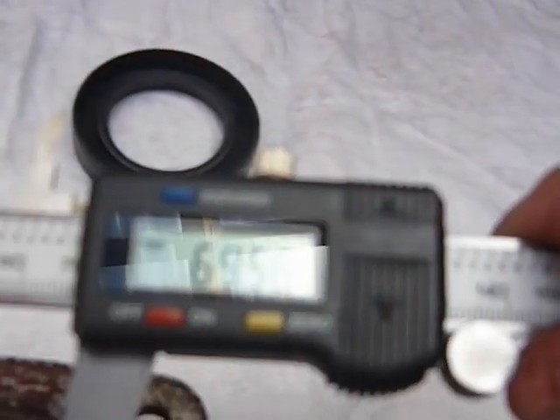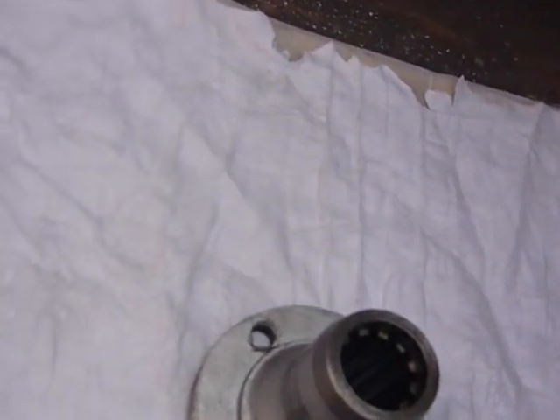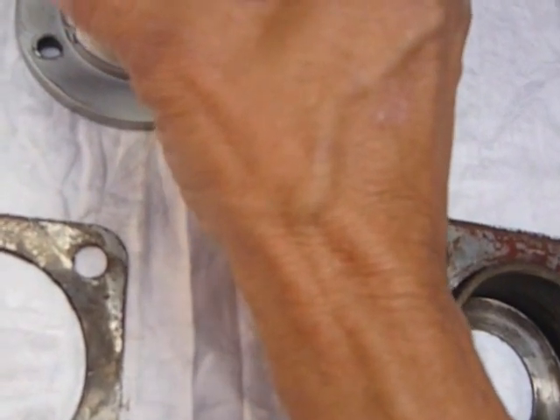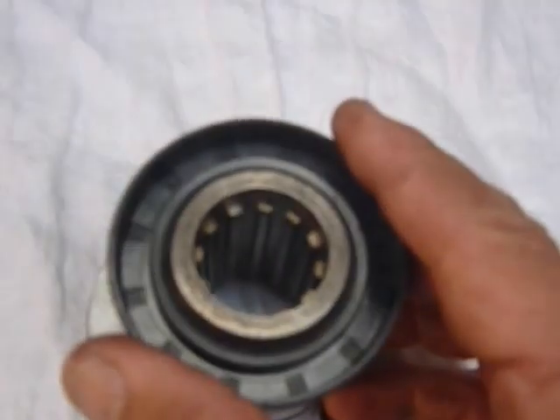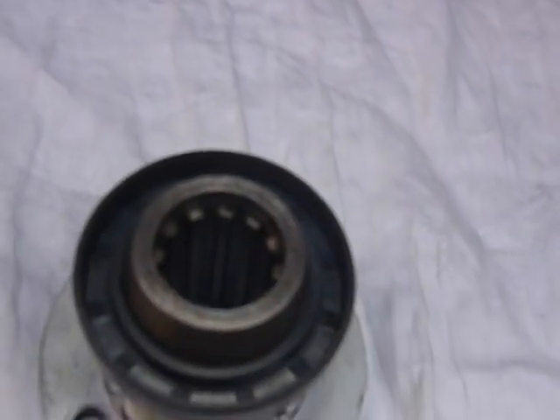When we measured this — I've got a good quality measuring device here — you measure the outer diameter, which in my case is 69mm, so you'll probably buy a 70mm seal. For the inner diameter, in this particular case we're at 44.5mm. Interestingly, I measured the worn bit and it's a few thousandths smaller — that's how much it's worn down. Although we ordered a 70 by 44 seal, the seal manufacturers are clever enough that they calculate they'll need a bit of tension and pressure to stop oil escaping, so what gets delivered is actually about a millimetre smaller, so that when you push it on it expands just that wee bit and grips the shaft enough that the oil won't leak on the floor anymore.